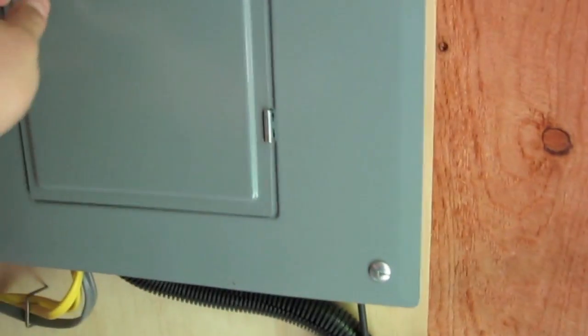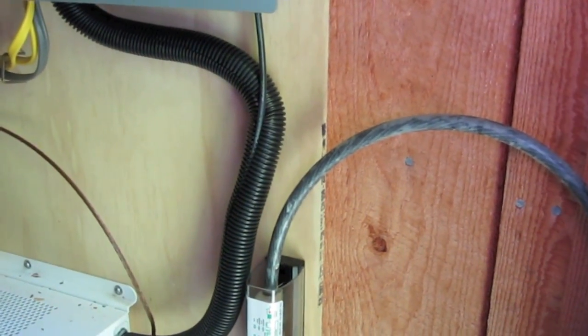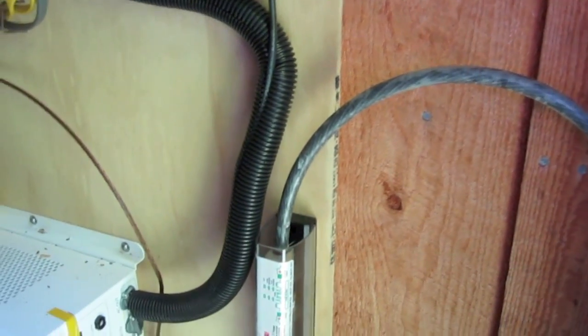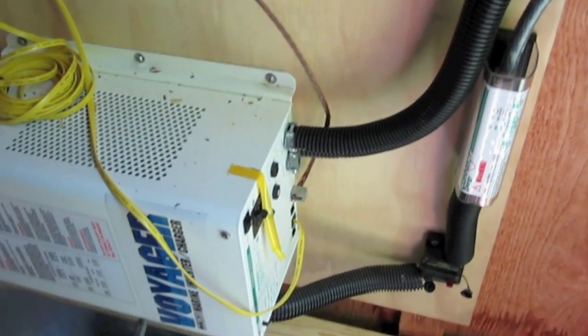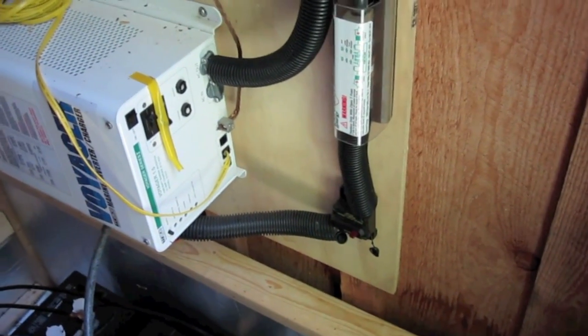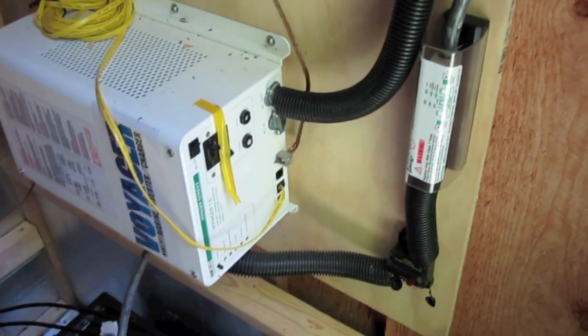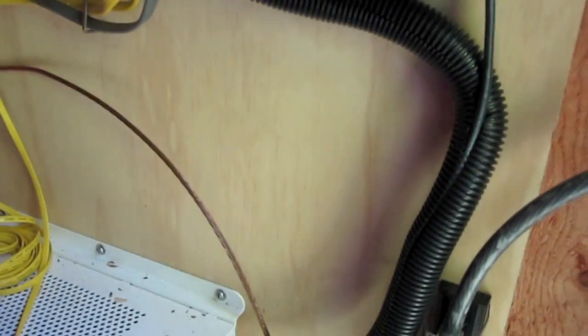It requires very little of my time. Other than topping up the fluid in the batteries, there's not a lot to it. To work on it you have to take the case off because the wires come in and connect on the inside. This is also a charger — so if you have AC coming in it will charge batteries, though I've never used that feature. I have a remote on/off switch — this yellow wire goes inside so I can turn it on and off from indoors. All the wires come out and go up into my panel.